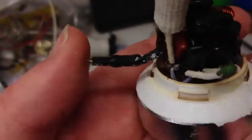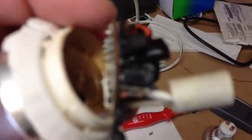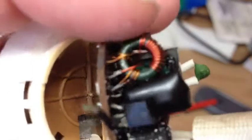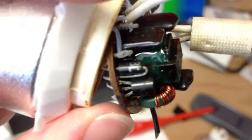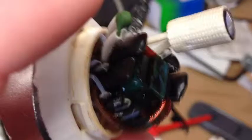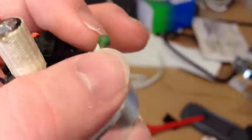Inside there, I'd say that is a resistor - possibly a fusible resistor. I think that's an inductor of some kind, maybe some filtering or something. Switching transistors. And there, that leads to the lamp. I'll unsolder those in a minute. I think this is a thermistor, which only activates the filaments at the initial power-on then cuts off. I think that's what it is - I could be wrong.